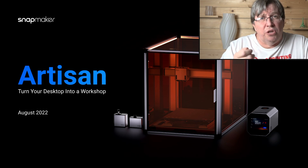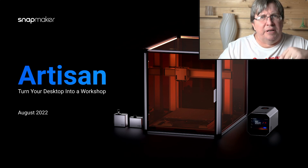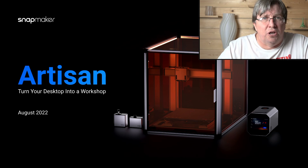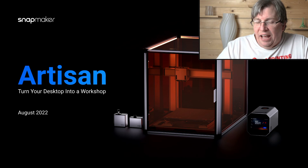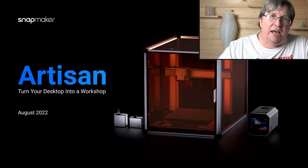The 3D printing side is gorgeous — you can swap out two nozzles, and they are independent extruders. I've seen a lot of 3D printers where you can print two materials but it goes through the same nozzle, so they have to be the same material or two different colors and you need a purge block. You won't need a purge block with this because you've got two nozzles, two independent extruders, two independent materials, so you can print with multi-material — and to me that is absolutely awesome. It's also got a control box on the side that is a separate unit, air-cooled, with a nice big touchscreen that you can use to control the machine.